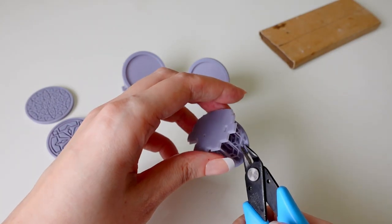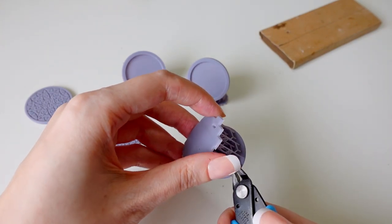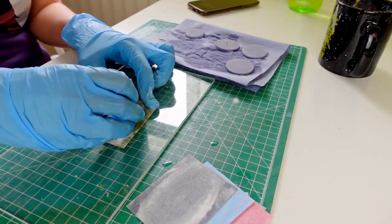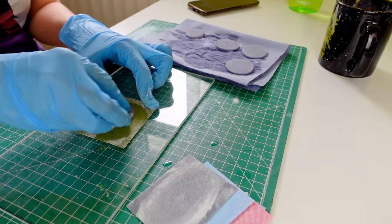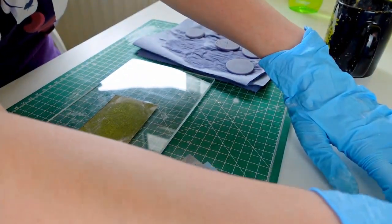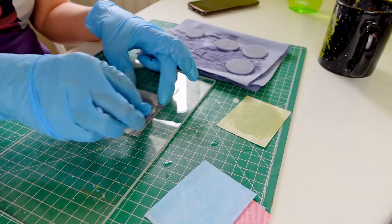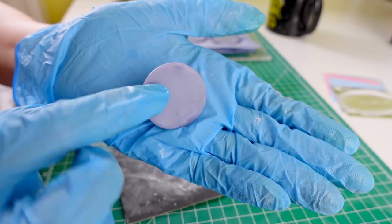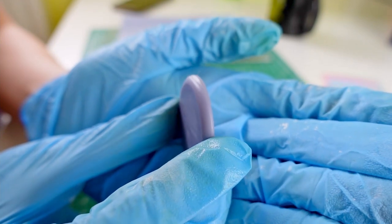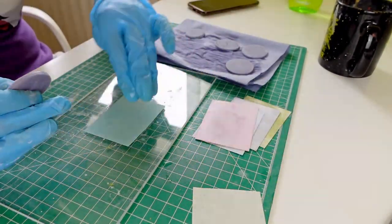The next task then is to use these masters to make silicone moulds. However, before we can do that comes the really boring part: clipping off the supports, and sanding and polishing down to a smooth shiny surface. Basically, when you're casting moulds, the more effort you put into making your masters pristine and perfect, the less clean-up and fixing you need to do on every single thing you go on to make with that mould, so it is worth taking some time over. I didn't care about the backs of these being perfect because they're going to make open top moulds, but I still needed to sand down the lumps and bumps left by the print supports so that silicone doesn't creep underneath them too much and make everything messy. As well as the prominent ridges from printing, there's a slight print defect on the edge of this solid one, so I had to take care to try and buff that out as much as possible. I'm also realising that I should have printed most of these out much thicker to make for easier sanding, but that's all a part of prototyping. We live and learn.